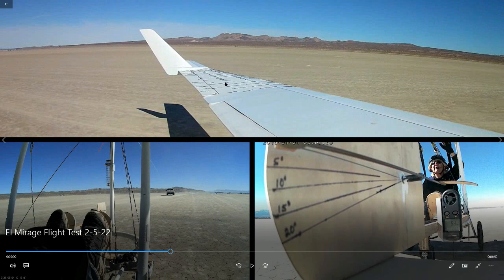And I should point out to you that these tufts that are turned around backwards on the wing, we forgot to clear them. They're actually stuck to the edges of the tape. And despite the fact that we're going 15 miles an hour, they will never straighten out. So you have to just kind of watch these tufts here and maybe the ones out here. But the flow conditions looked good overall.